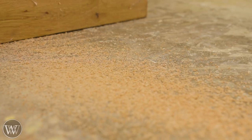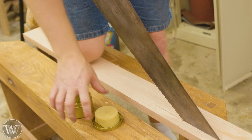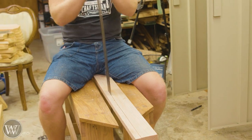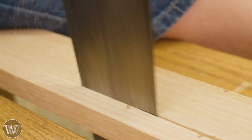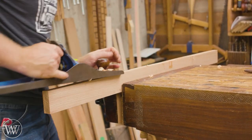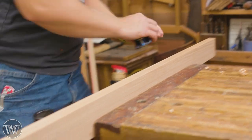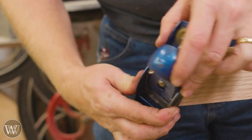We're ripping it down with a handsaw — there's just something nice about hand sawing. You get the dust, and when you're done there's a solid sense of accomplishment. A little bit of paste wax on the saw if it's binding up, and it's amazing how fast that gets it going. There are a bunch of different ways you can hold a saw, and if you get tired of one way you can switch. Once that's done, we can plane it down and joint it nice and smooth. It doesn't really have to be perfect — it's a clamp — but let's do this right. Chamfer off the corners so you won't get any splinters, and round over anything that's not comfortable in the hand.